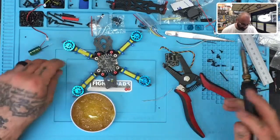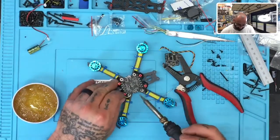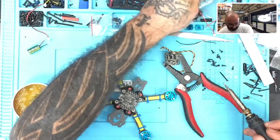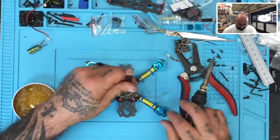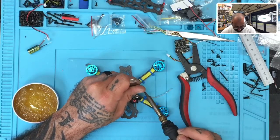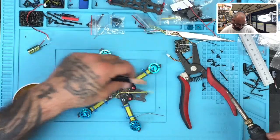I'm going to use that yellow wire as my ESC telemetry wire. I'll come in from underneath so the wire isn't unnecessarily exposed. I'll clean off the tip of the soldering iron and come in to solder it to that pad right there — very quickly. I think I got it pretty good. That's done, and now all I have to do is make sure I route it properly.